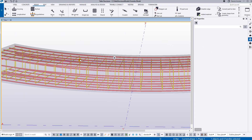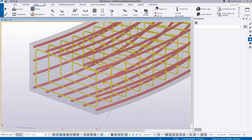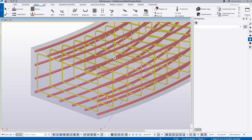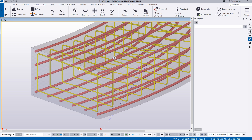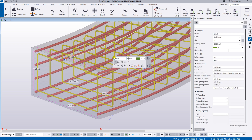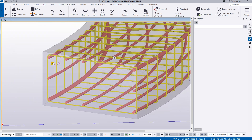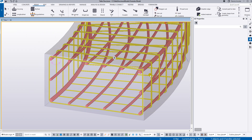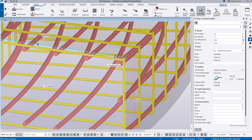As you can see, this rebar is inside the longitudinal bar. What I will do is use Direct Modification, select the rebar links, and there is an option to move to the outermost layer. If I click on this, as you can see, everything moves to the outermost layer.